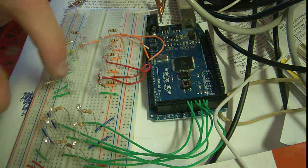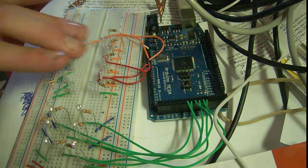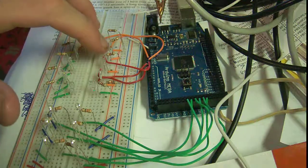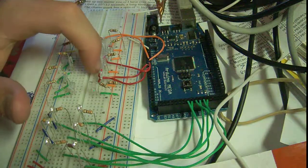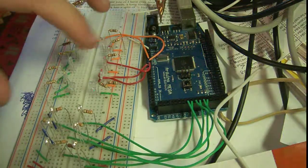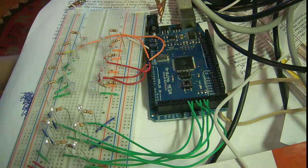For each emitter, I have three here, with the corresponding three detectors here, and same with these two. So what happens is there's a beam of IR this way, and a beam of IR this way. When the beam is broken, like here, this sensor and this sensor aren't getting as much IR, so the reading drops. So then it can tell that you've touched there — if you put your finger or pen or whatever, it'll block the light going to those sensors. It's very simple.